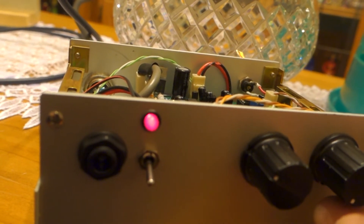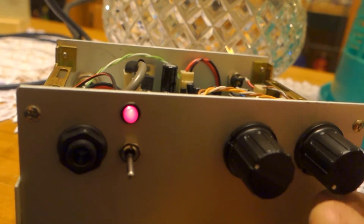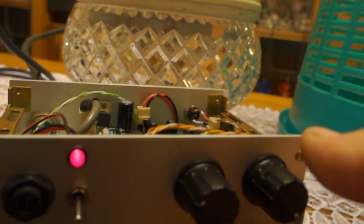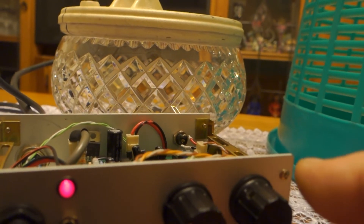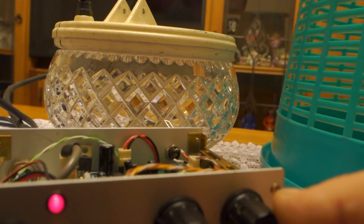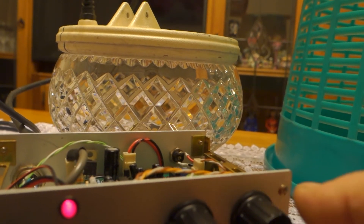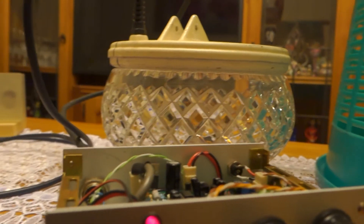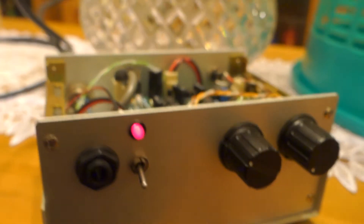Apart from that we've got a delay control — a sampling delay. This is a very short sampling delay of about six to seven microseconds, and you can advance it all the way to about 55 or 60. The sampling delay pot is used to help discriminate between aluminium and gold. It gives you less of a response to aluminium tabs. Normally if you've got a reasonably good fast coil, you tend to have it at or near the minimum delay setting — that's where it's most sensitive to small pieces of gold, which is basically what I'm going to use it for.